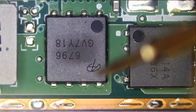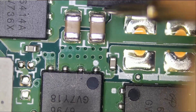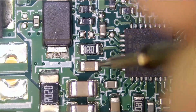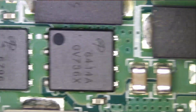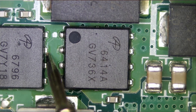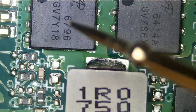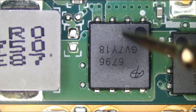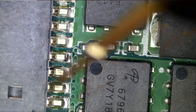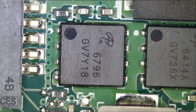We have a short at this part of the MOSFET; gate is good. No short on the caps. We have a short here — the MOSFET labeled 6796 is shorted from the source. Short here, short here, and short here. I do not know if we can get a diagram for this MOSFET or find it online.